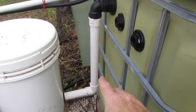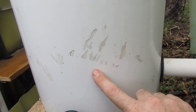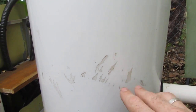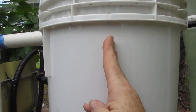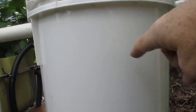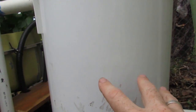This existing pipework — most of it's actually bits left over from the overflow. So the water tracks down here around this 90 degree, and then in here I've actually got two 45 degrees that meet and make a complete 90 degree turn. The reason you do that is if water was to come through and hit a 90 degree and then try and go up it would retard the flow. So if you have a nice gentle 45 degree the water tracks up nicely, a little bit smoother, and up through the outlet pipe. That outlet pipe actually sits inside a pipe inside — the water comes up, hits the sides of the pipe and is redirected down. There's no holes at the top; it's redirected down to flow underneath the pipe and then into the main chamber.